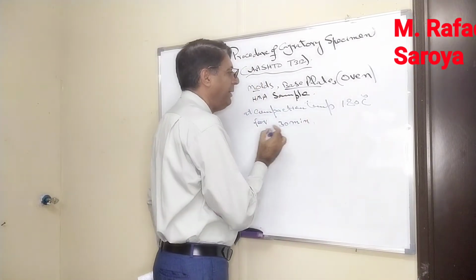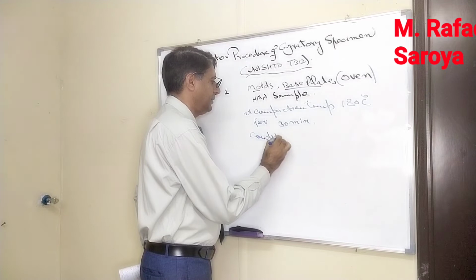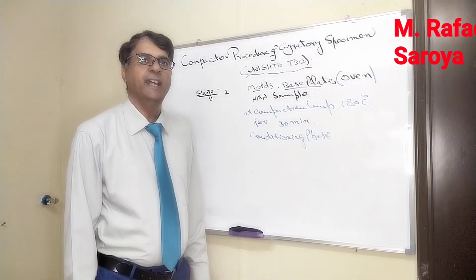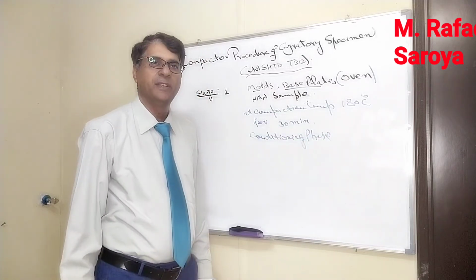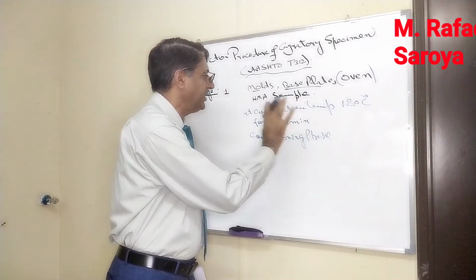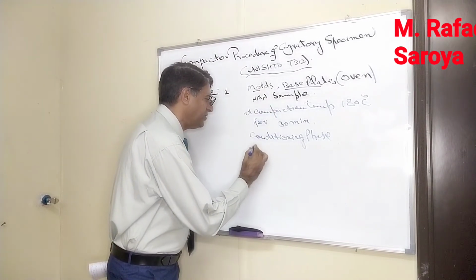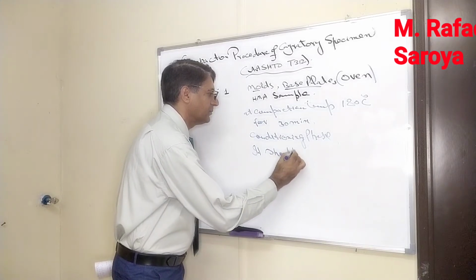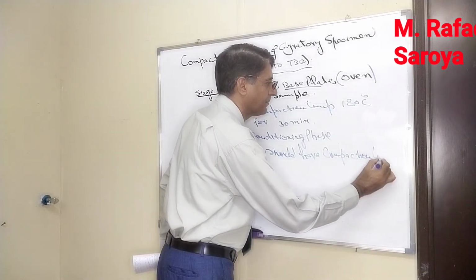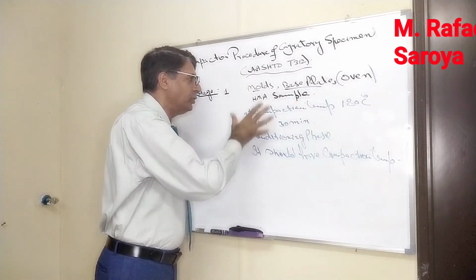Second, this sample should have gone through the conditioning phase. Conditioning phase is mandatory because we are in the lab, making the lab trial. So this sample should have gone through the conditioning phase, which is 2 hours. We have to keep it in the oven and stir it after every 1 hour. So this is the conditioning phase. And after this conditioning phase, it should have compaction temperature. It is mandatory. So this is my stage number 1. In stage number 1, we have to do this adjustment.